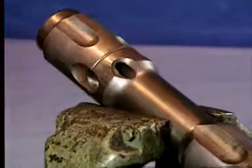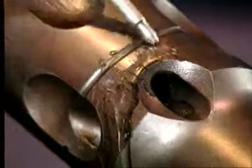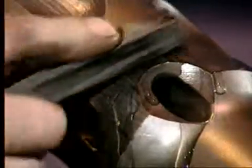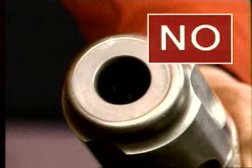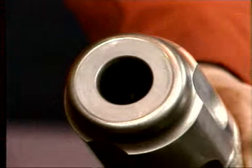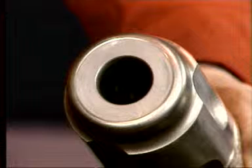Inspect the piston top bore for heat scores. Also check the piston oil ring grooves for burrs and clean with emery stone. Check the piston striking face for cracks and indentations. If evident, replace the piston. Inspect the diameter of the piston foot valve bore, which may have been reduced through constant impact, leading to premature failure of foot valves. You can remove a small decrease in bore diameter with a hone. Otherwise, the piston should be replaced.